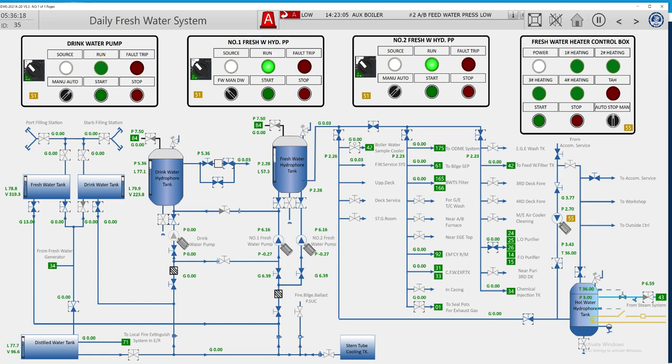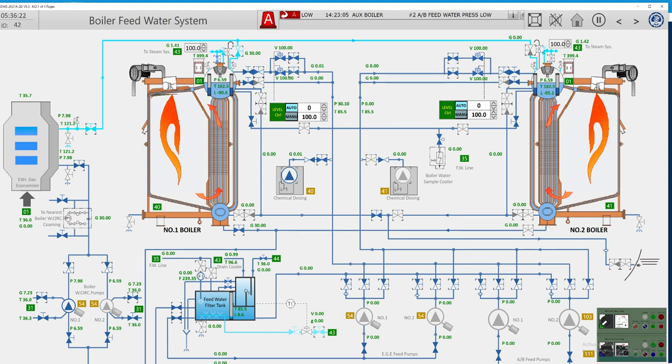All these things must be taken into consideration — they play a really big role when you are filling. This simulator gives us the opportunity to see real-life items in a controlled area. Also, the person checking the feed filter tank every day should keep a note about how many liters they're filling, as a control of boiler water consumption.